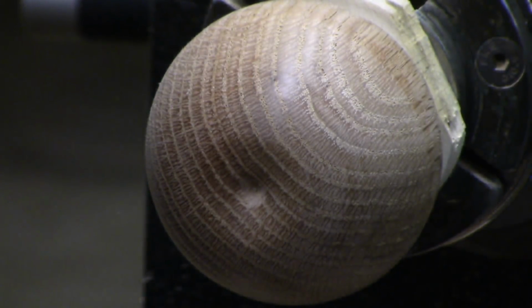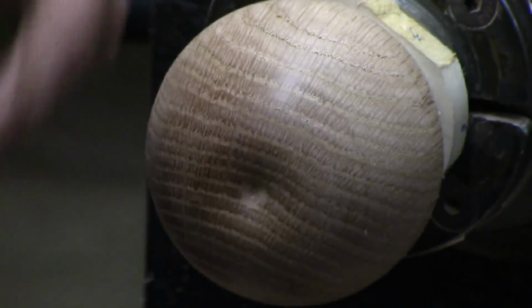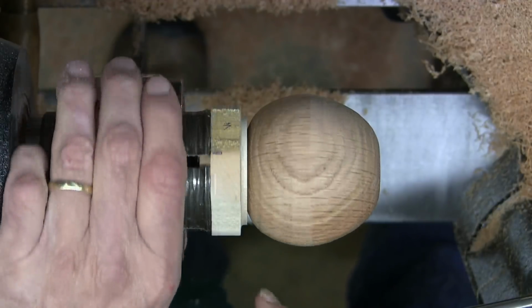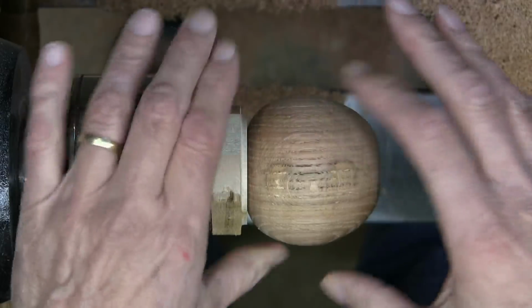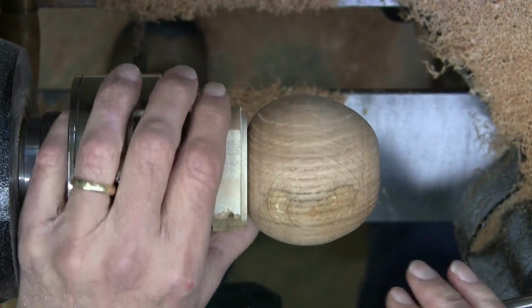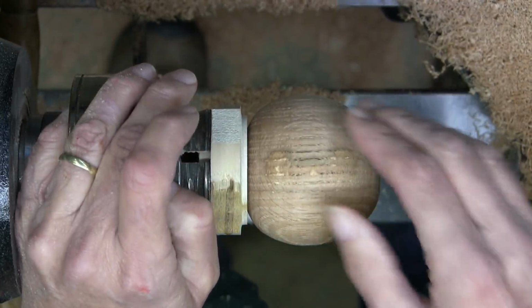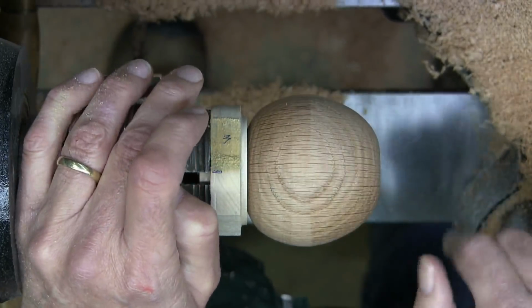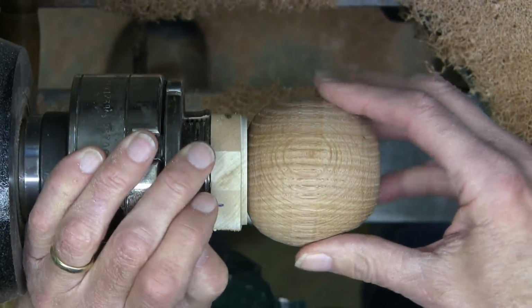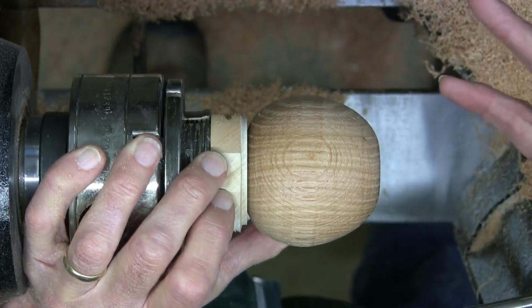and you will see. I don't know. Can you see? Can you go? Or you go from above? So you can see these two planes, this was turned one way and this is turned the other way. Yeah, but it's not too far off. You probably start with about 150, and you want to keep this curve as you sand. Okay, so that's why you'd like to try to turn it nicely, so you don't have to sand it with 80 grit or something like that.